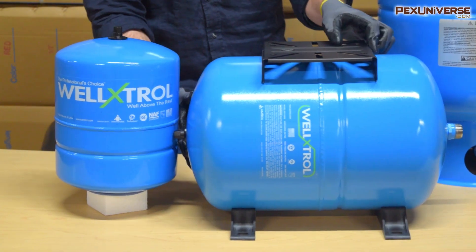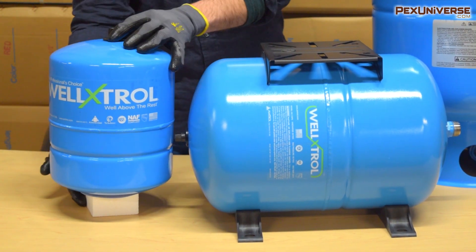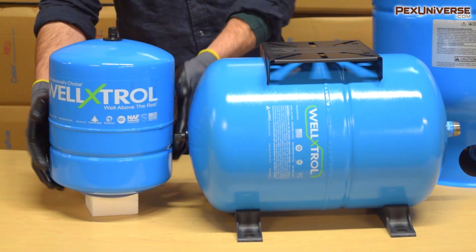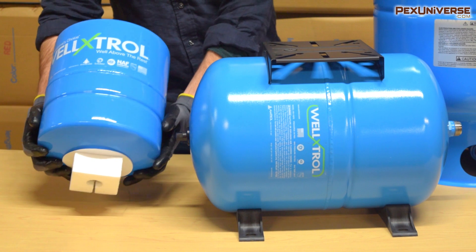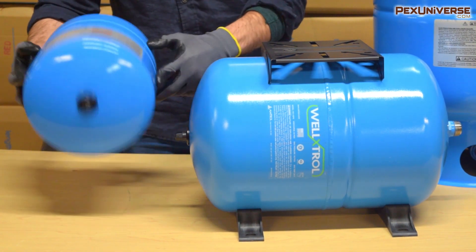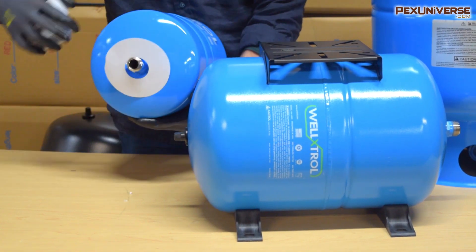The location where these are most often installed is adjacent to the pump. The well pressure tank can be used whether pumps are above or below the surface, and in either case it protects the pump by reducing surge, dampening pressure spikes, offering a point of pressure control, and providing minimum runtime. This location also permits all equipment to be placed in an area that's both serviceable and secure.